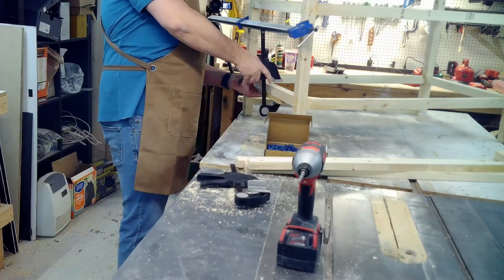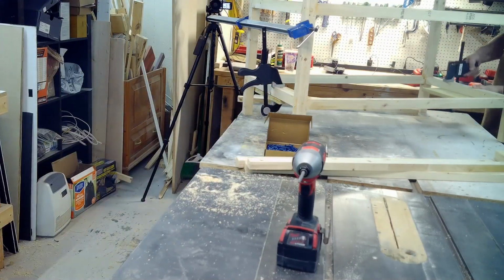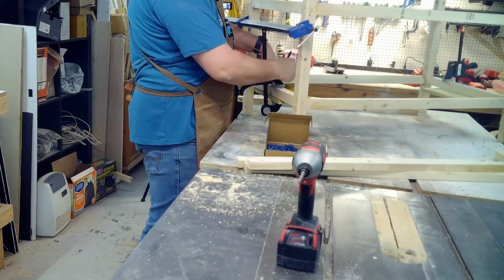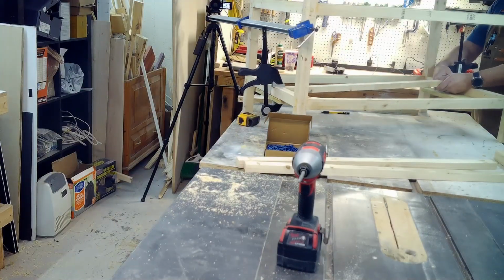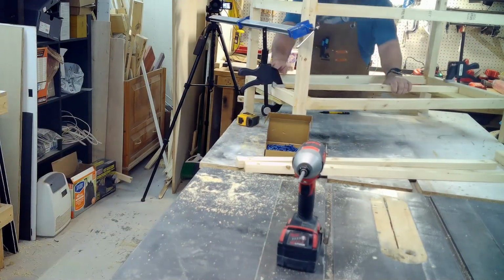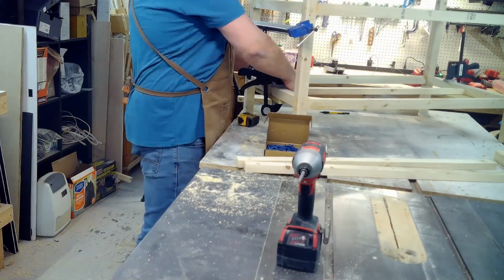After I composed myself, I began attaching the supports. I measured the middle of the sides for the top support under the bed and the support in the middle of the shelf. I attached using a little glue and pocket screws. You could attach this with the pocket screws facing up or down, just a matter of preference, but I decided facing up because the shelf panels would hide the screws, so I chose up.